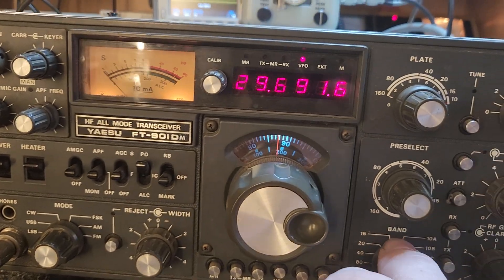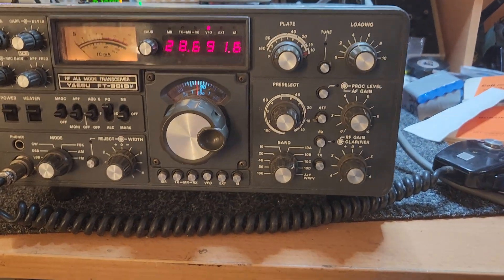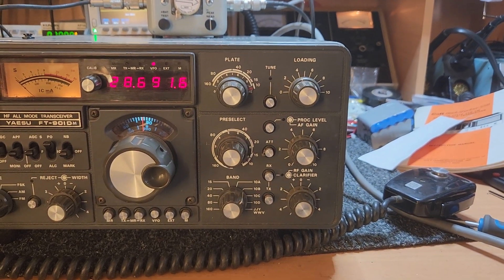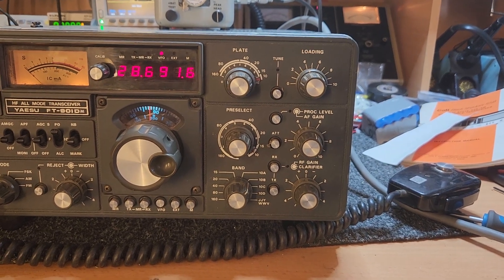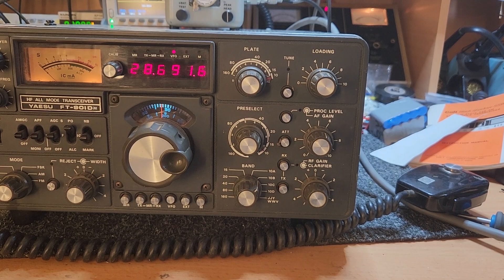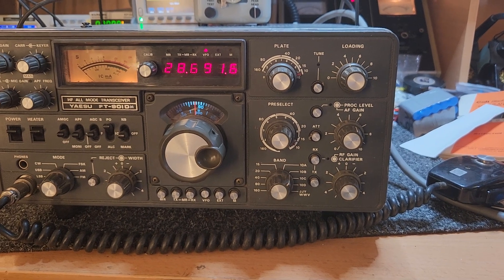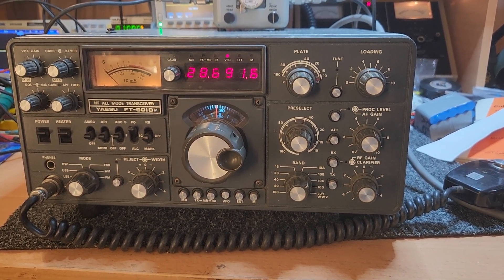Then you go to JJY/WWV, then back to TMD. I'm probably thinking more of the 41.5 MHz crystals — thinking more along the lines of when people would take them off the FT7s, FT7Bs, 101ZDs. I think the FT707s were the 41.4875 MHz crystals, and the FT101ZD from memory was still the 41.5 — correct me if I'm wrong in the comments on that one. I know they went to 41.4875 for the conversion for FT707s over the years. From about 2010 onwards people have been more into restoring these rather than converting them.